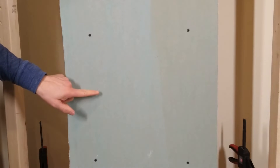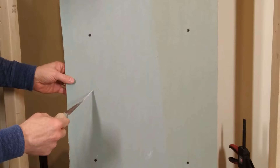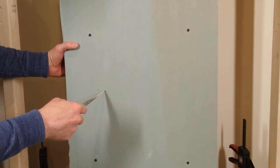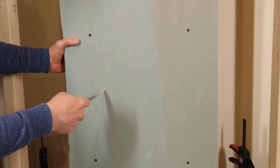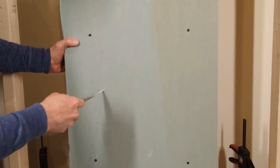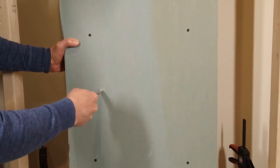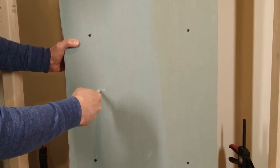Next we need to cut the hole for the box. Now that we know where the bottom corner is approximately, I'm going to start cutting diagonally from where the cavity is towards the stud, starting about an inch away from where I believe the stud to be, using a jab saw. I'm not going to use a power saw because we don't know what's behind this finished wall — we could cut into a water line, a drain pipe, or another electrical cord. So I'm going to carefully cut towards where I believe the stud to be, and when I feel that I've hit the stud, I'll stop.